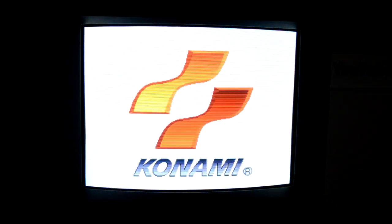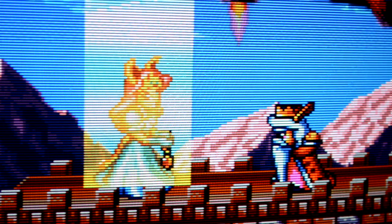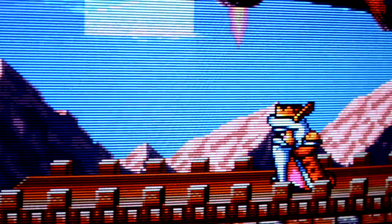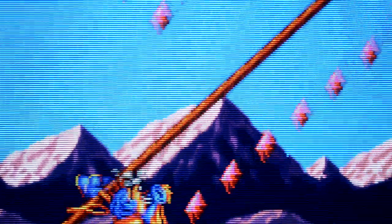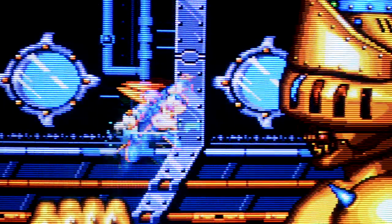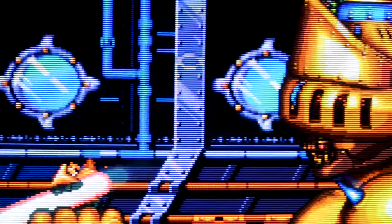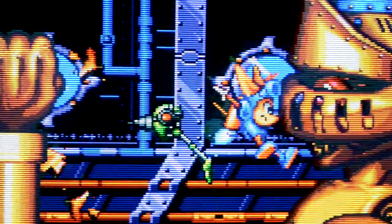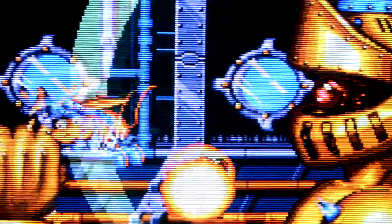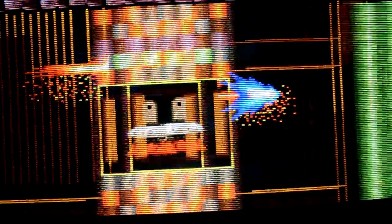This Olympus and many other Olympus CRT monitors are exact copies of Sony PVMs. The OEV 143 is the same as a Sony PVM 14 M2 MDU. These monitors support both 240p and 480i video resolutions. It has inputs for composite, S-Video, and two switchable inputs that can be set to accept either component analog video or RGB analog video. The tube on this monitor has a 600 TV line picture resolution — it will show very nice scan lines, but they are not over-pronounced as is the case with some higher line count BVMs and other displays. This monitor is easy to adjust through the service menu.